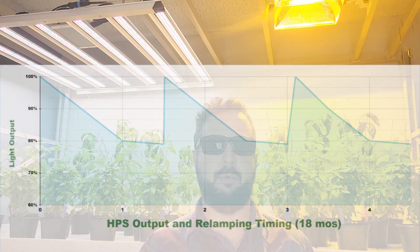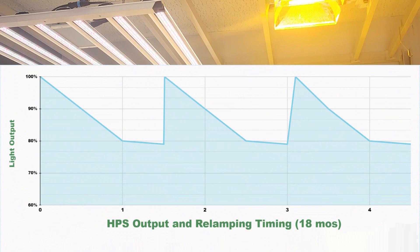It's really important when determining a lighting strategy or transitional strategy from high-pressure sodium to LED to understand the quality of the hardware you're hanging, the light degradation curve of the LED, and also make sure that you're relamping your high-pressure sodium on proper intervals to ensure you're getting the right production. Whether you're transitioning from HPS to LED, building a new facility running only LED, or running a combination, you need to understand the light output and degradation of the fixtures you're purchasing.